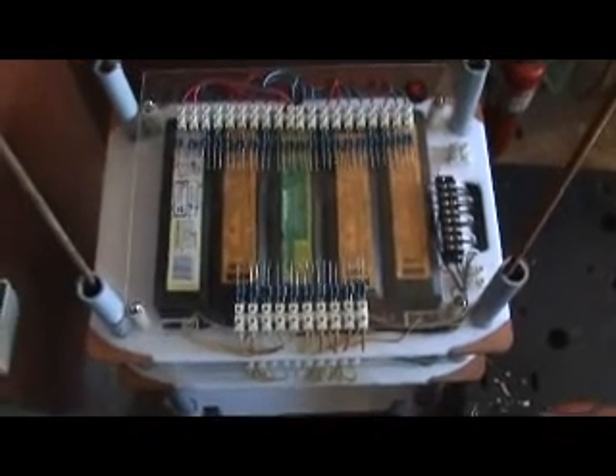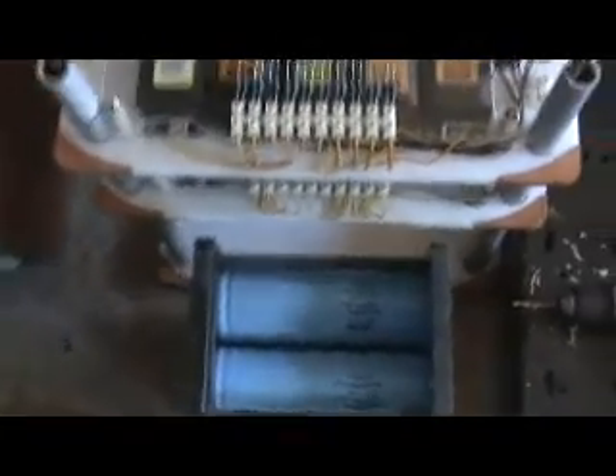I've had extremely great results using low voltage DC with these transformers. Here's a cap pack I built quite some time ago — I think this is all drawn up and posted publicly on overunity.com. There are six capacitors in there at 40 volts, so 36 volts thereabouts is a good working range for them, maybe 38 volts. These two kicker boards — this is going to sit like this and go in here where the battery was going to go.